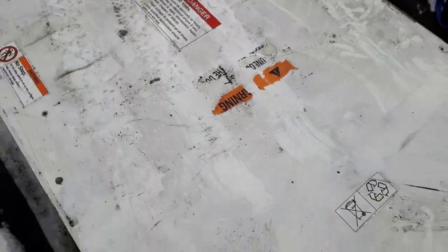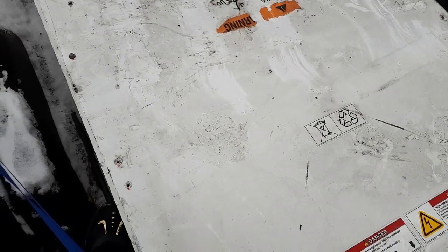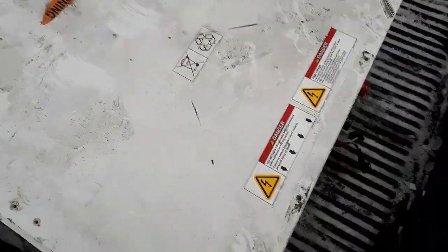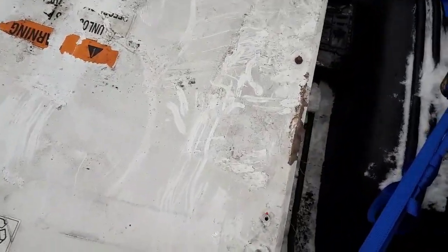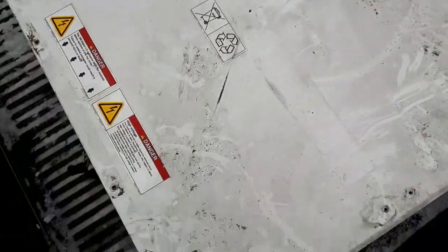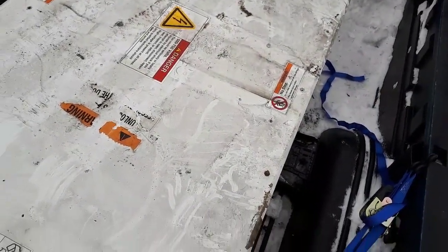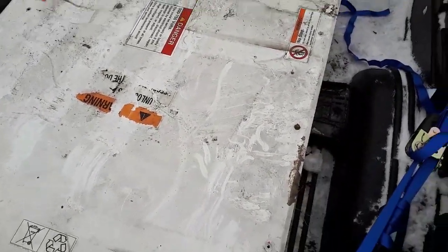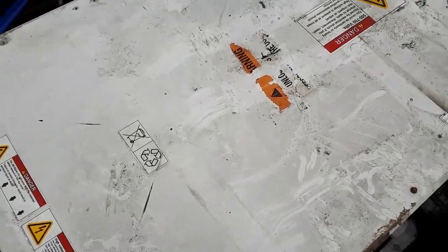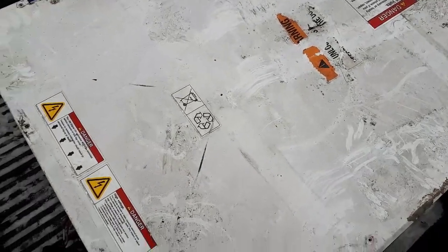This is a lithium iron phosphate battery pack. These are A123 cells, cylindrical cells. Pop the cover here and check the voltage of the one pack — it was at 39.3. It's a 12S pack, so that brings it to its nominal voltage of about 3.3 volts.